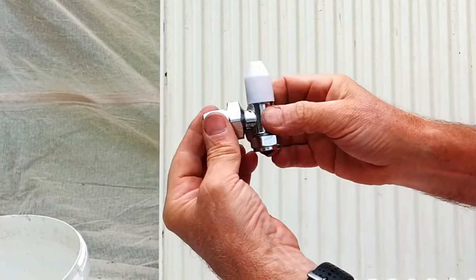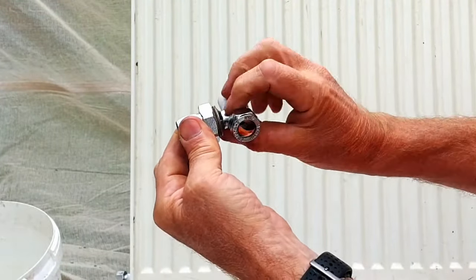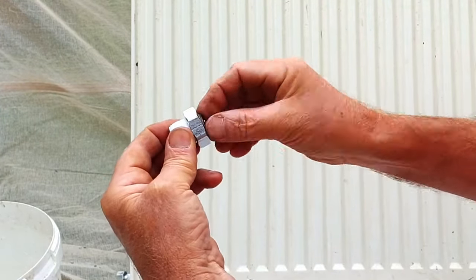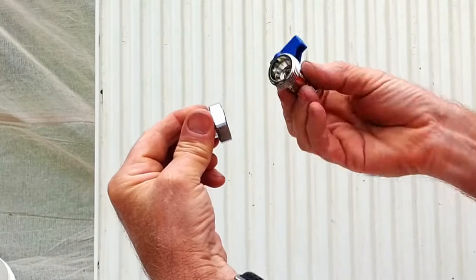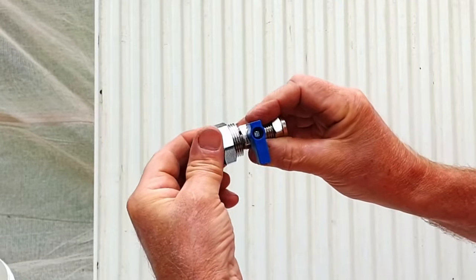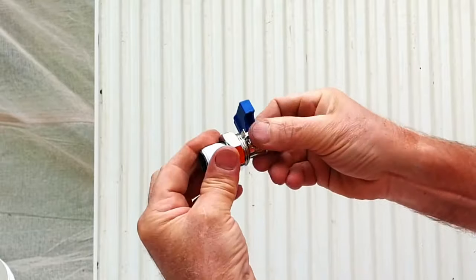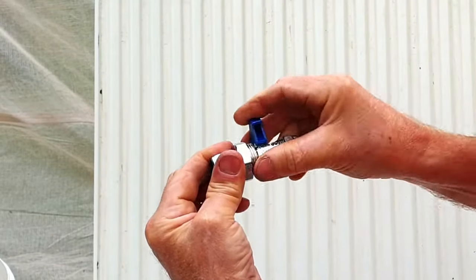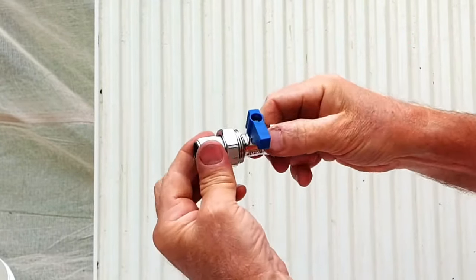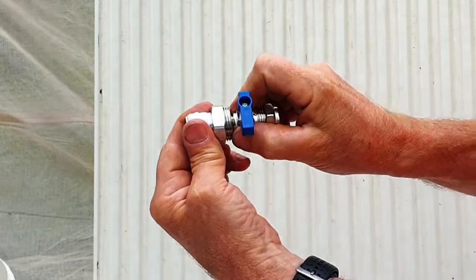I just want to show you a little tip: if you've got a radiator valve fitted with a big union, the radiator valve comes off and you're left with that big nut on the radiator. Trying to fix onto there is difficult, but you can use a washing machine valve to get a good connection onto there — it's the same size nut. It might leak a bit because it's not a perfect fit, but it does mean you can open and close it and get a good flush of water going through. I hope that helps as a tip for connecting onto these larger union nuts.